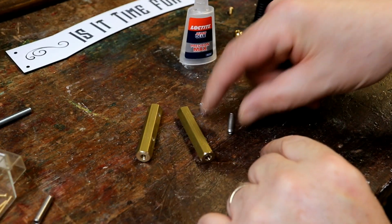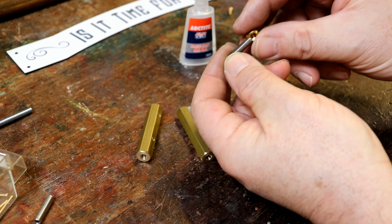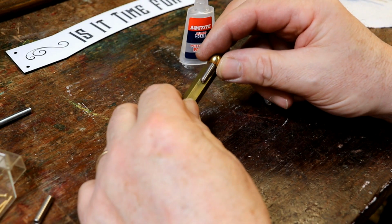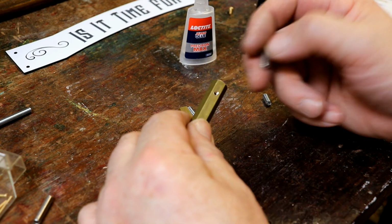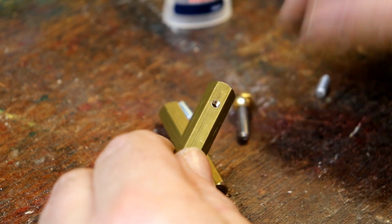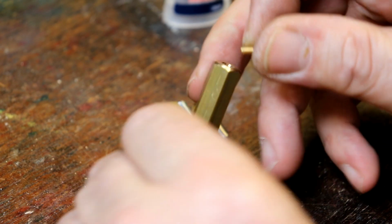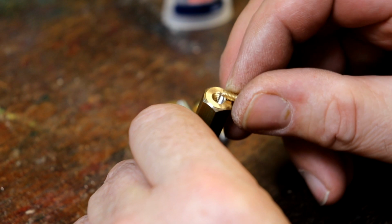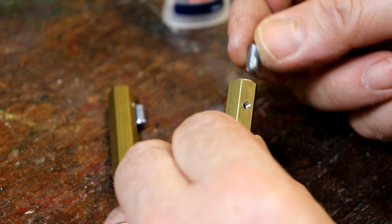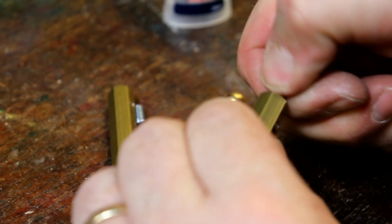What I'm going to do, originally, like I said, I was going to use these M5 studs, but they don't go into the balls enough, and so much of it goes down into the top of this bit. I think with my M3 screws that are going to screw onto the front of this, they're going to go right through this and want to have a bit more space, a bit more depth, so it's useful having that hole inside. To cut a long story short, I've just sawn up an M5 bolt to get two very short bits, about a centimetre long, which I haven't rounded the ends off properly, but there you go.